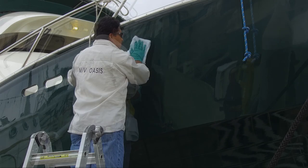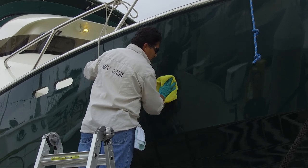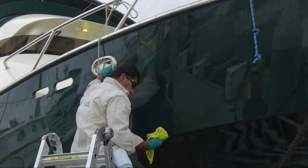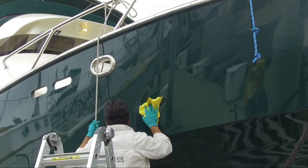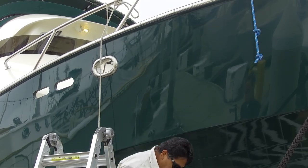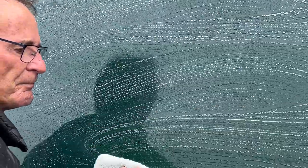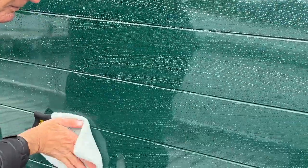When it comes to the washing of the boat, we use Awlwash concentrate, which has a mixing ratio of 1 ounce per gallon. It contains no alkalis, acids, or abrasives. It rinses off better than other soaps we have used, so it minimizes the buildup of soap deposits and it decreases the drying time. It also has the advantage that it is compatible with their formulation of Awlcare, so it removes less of the sealer with each application than you would otherwise find using other boat washing products. That said, we use Awlwash sparingly and only when necessary to remove soot or pollution. Otherwise, we are usually good to go with just a high pressure rinse.